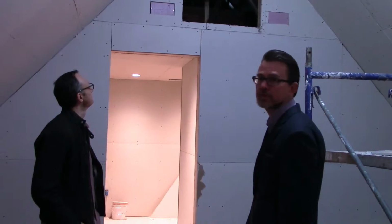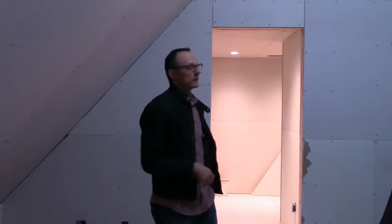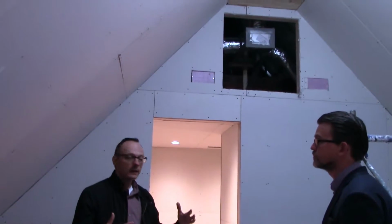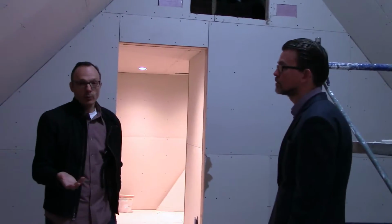Vlad, you want to tell why you picked the system? Yeah, we picked the system because, as Bo mentioned, it has a very high efficiency ratio, both in the summer and in the winter. And basically it ensures that, unlike a lot of modern houses nowadays that are getting more airtight, you need a balanced ventilation system. So you're bringing in cold air from the outside and transferring the heat from the warm air inside, and ensuring that you have really good ventilation inside, but also filtered air. So that's, I think, a really important thing about this building.